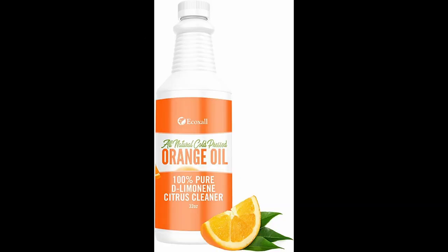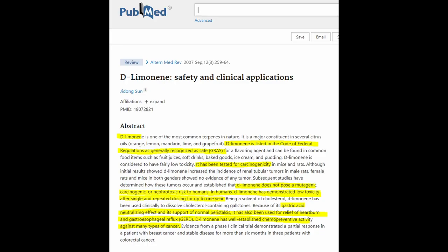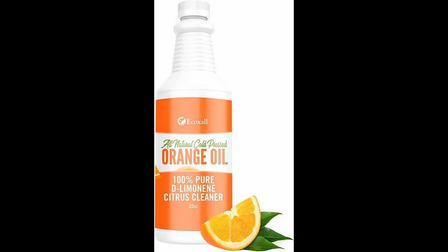D-Limonene was better than RBC and Mineral Spirits. It has a very strong citrus smell that I still found pleasant, and it dries almost as easily as Mineral Spirits. I'd say this is the best overall cleaner when considering health, effectiveness, and drying. It is extremely safe — in fact, some people take it in pure pill form for digestive issues. The FDA categorizes D-Limonene as generally recognized as safe when used as a food additive for synthetic flavoring. It occurs naturally in citrus fruits, making it probably the safest cleaner in this whole test — essentially a pure, highly refined orange oil, making it a bio-based product.